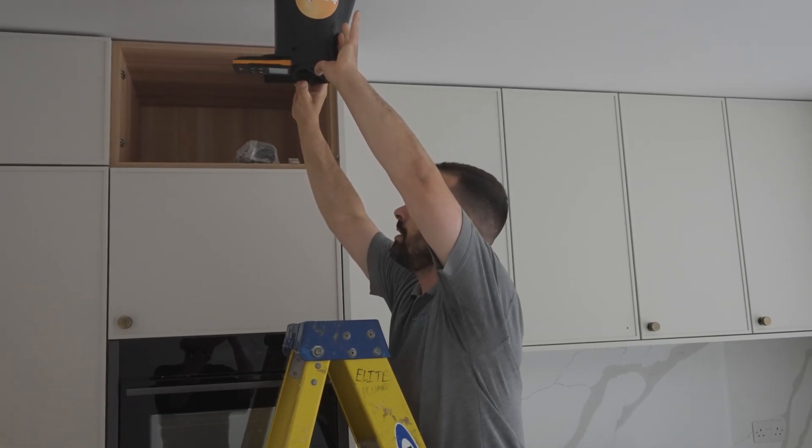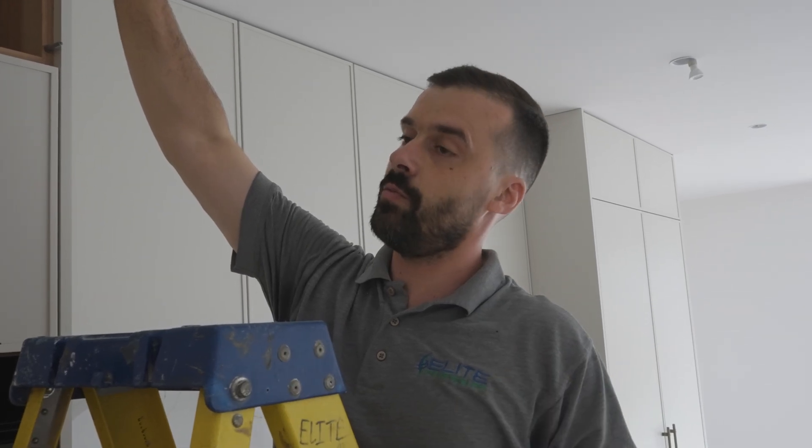This vent we haven't got enough airflow. We need to go back to the other vents which are close to the unit, measure them, and if we've got more flow there we need to lower them down. It's very critical when balancing your MVHR system that the whole house is balanced.